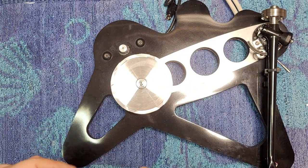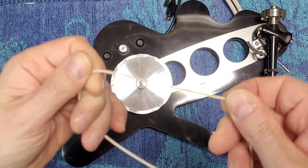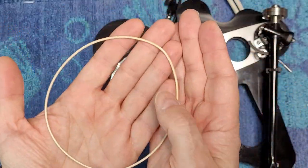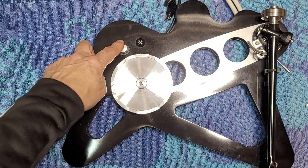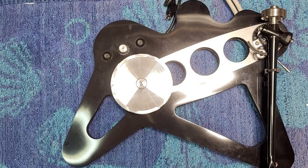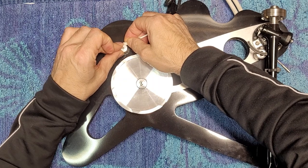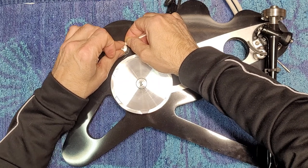Lastly, the belt. Like I mentioned, this belt is a little bit dirty, which is very weird. I'm going to put this in some warm water for a bit and see if I can get it back to its natural shape — there's a little bulge — see if we can get that out, and we'll clean it with alcohol. In the meantime, I'm just going to put a drop of oil on the motor base here — just one drop right at the base. Also grab a Q-tip with some alcohol and just clean where the belt rides for 45 and for 33 — just want to clean those two spots there on the spindle.